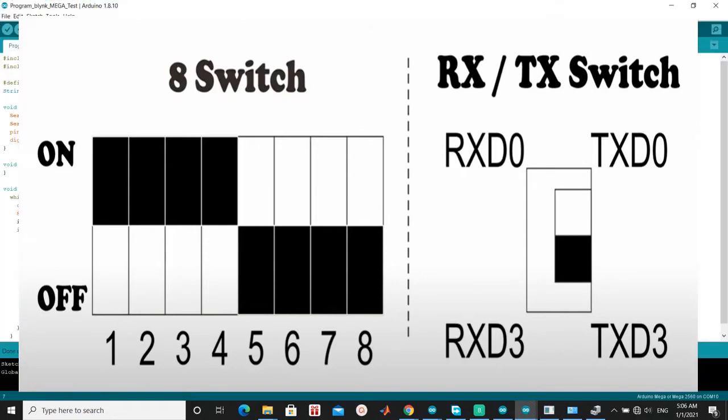After finished, switch back to mode: both Mega Wi-Fi plus ESP8266. Look at the picture — pins 1 through 4 On, and pins 5 through 8 Off. Set RX/TX to serial communication 3, and don't forget to press the mode button.